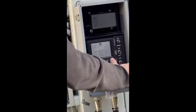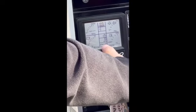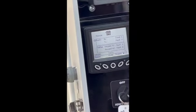Now, here you are in the morning, you're coming out. Yep. So you start the machine up. Right now we're in manual, so we're going to hit this middle button here on mode. We're going to hit that button one more time, drop this arrow down to the radio function. If the machine was started and the remote is on, we're now linked up to that radio remote.